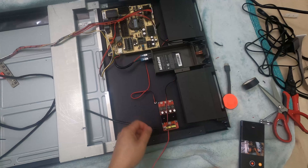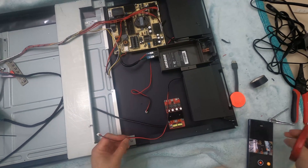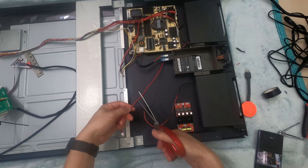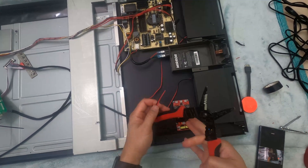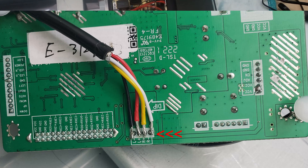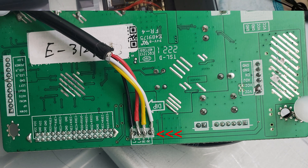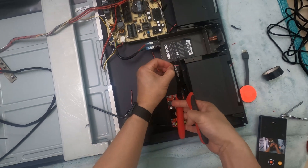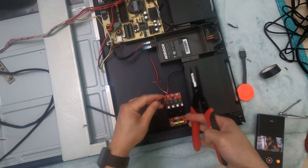To use the speakers is relatively simple. The red board is the amplifier — in another video I'll show you how to use it with the amplifier, but for now for simplicity we're going to connect straight into the new motherboard. The red wire is positive and the black wire is negative. On the back of the motherboard you can clearly see all the speaker connections: left minus, left positive, right positive, right minus. I solder all the connections down to secure it, and then connect it to the speakers in the mirror. Be careful with polarity.